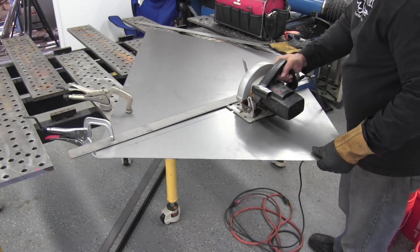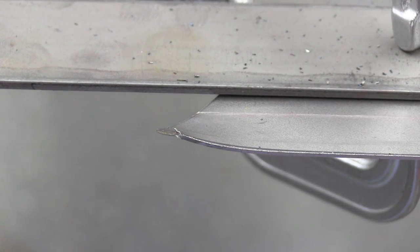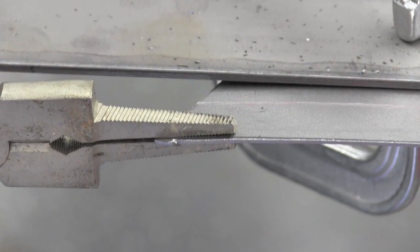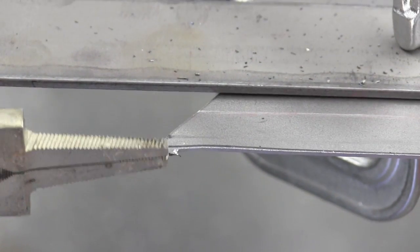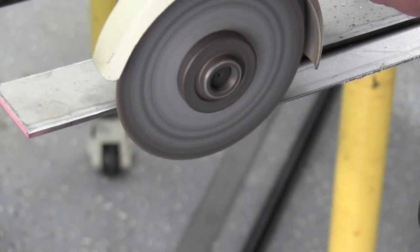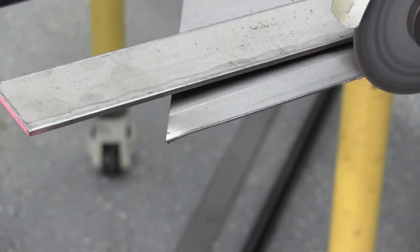We'll do this in fast motion here. So far I'm really satisfied, but sometimes it curls the end up and this is only 18 gauge — pretty soft stuff — so I'm flattening it out here pretty easily. Then I'll do a little dressing work with a slitting wheel, a cutting wheel on a four and a half inch grinder, and that will be no problem.